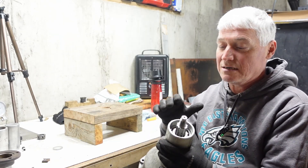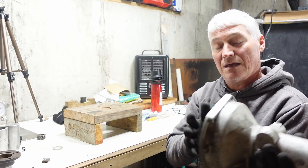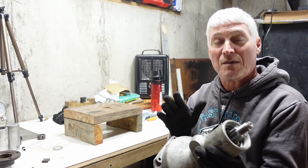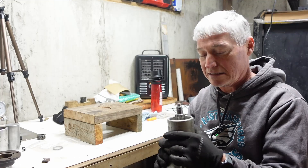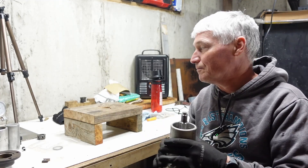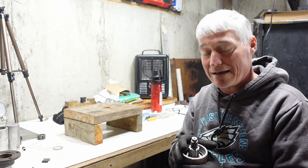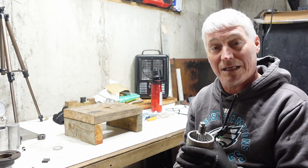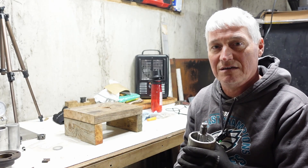One of the measurements in here is to measure its end float, and you've got a bearing up here and a bearing inside that you can't see — it's right about here or so. I'm going to pull this annulus out and replace the bearings just out of an abundance of caution. I've got spares here from Moss. There's a spacer in there that controls that end float, and I have a special tool that a gentleman on my favorite forum was kind enough to loan me. I'm going to use that to measure the end float, put it all back together, and it should be good to go. Thanks for watching — let's get it sorted.